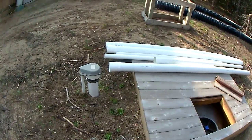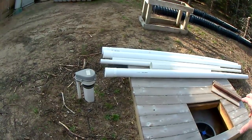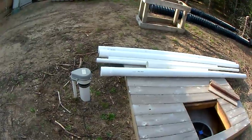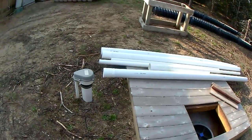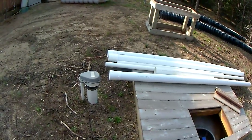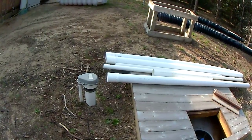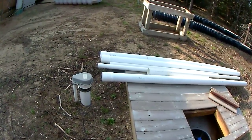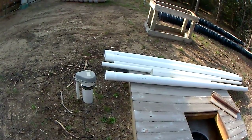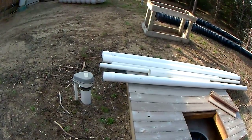Back to the well head part. I took a shower drain and replaced the plumbing that was in the side of the tank — that got me into normal PVC sizes. The tank is teed into this pipe, and then above the water level the filter system is teed into this pipe. There's what's called a pit adapter, which is what's in your well at home if you have one, and that's where the water pump sits down in the ground.